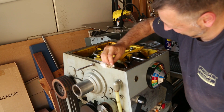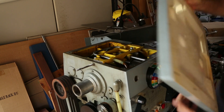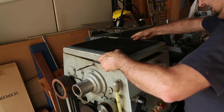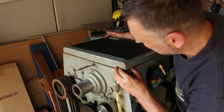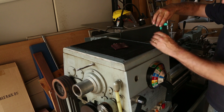After cleaning up any dribbled oil and making sure I had this as clean as possible, I also had to clean the headstock lid which had been heavily coated with this sealant. In this case I was actually able to scrape that off with a scraper and it came off reasonably well because the powdery residue it left was easily kept out of the chamber. Once I had done that I placed the headstock cover back on top and bolted it back down.